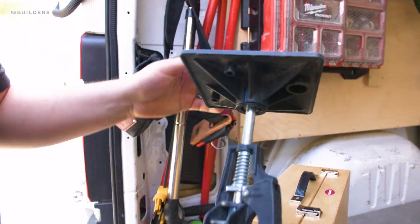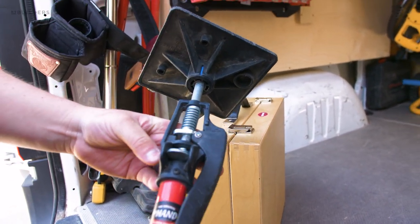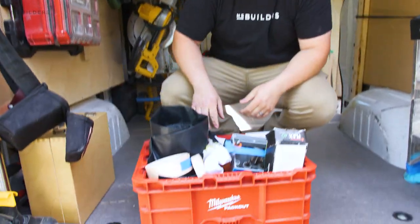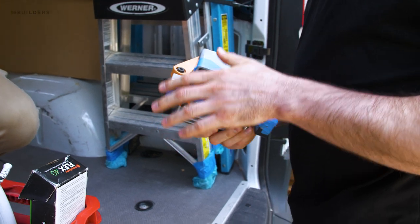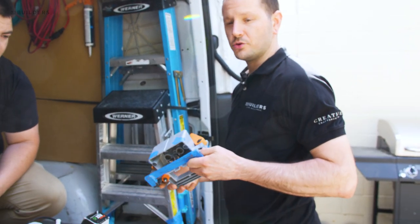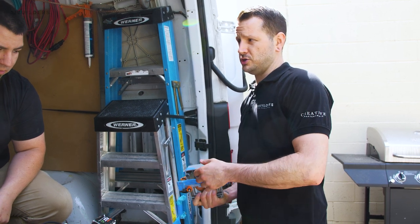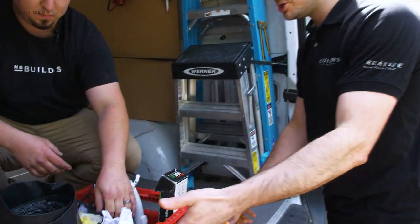There's this bag that looks like a mess - let's pull it down. It's kind of similar to the apocalypse box where it's got things that'll save time. Right off the bat, this is huge - you've seen the Blum mini press in our shop for boring hinges. This is their eco drill, which is just a jig to bore hinges in the doors. We used to use this in the shop before we had the mini press; now it lives in the van so James can add hinges wherever he needs to with ease. There are situations where we don't bore the doors in the shop because we're not sure exactly where it's going to land, so it's super helpful to have in the van.